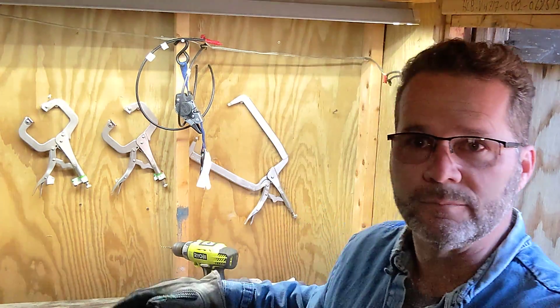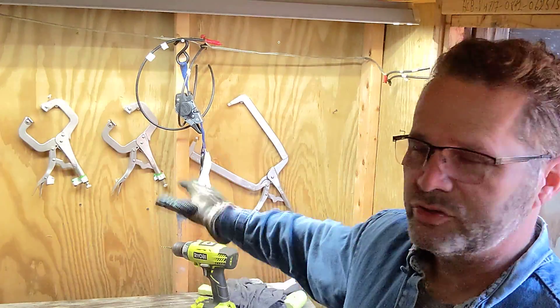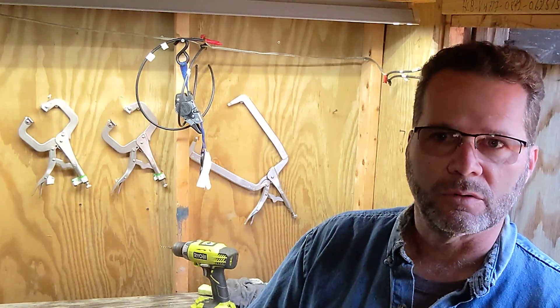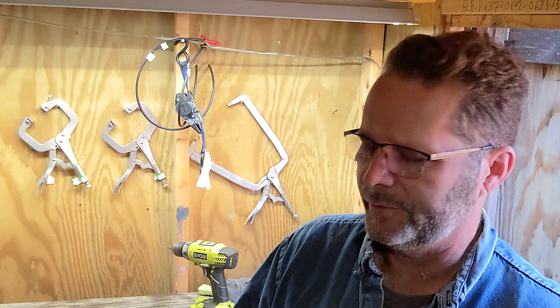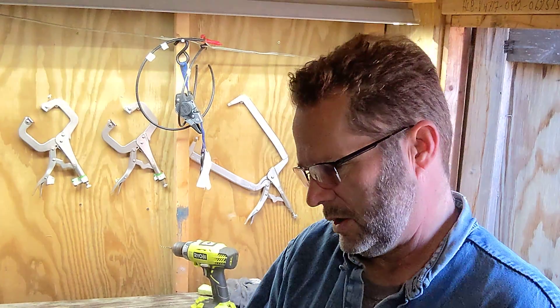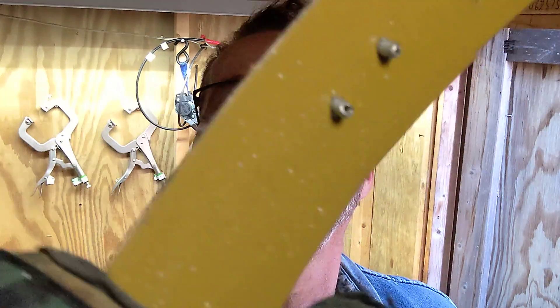This is one of my assembly areas inside a shed. Workbench, with all these tools hanging up to make this happen — cutting up these drums and using as much of the available material as I can. I hope this answers some people's questions about why I use rivets instead of spot welds. With a spot weld, there's no way to guarantee the integrity of that bond. With rivets, I can visually inspect each one to make sure they've fully bonded the two pieces of sheet metal together.